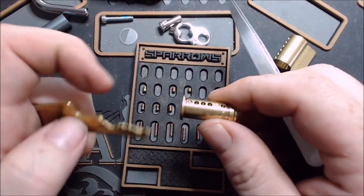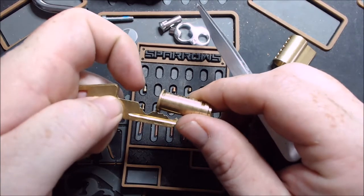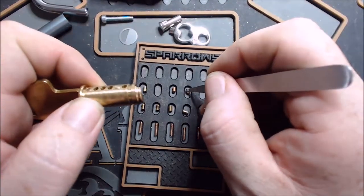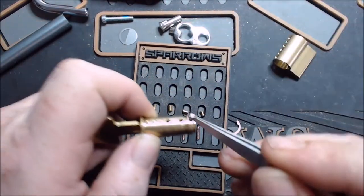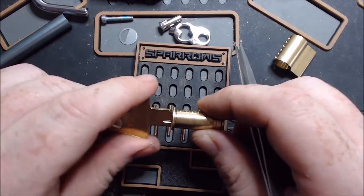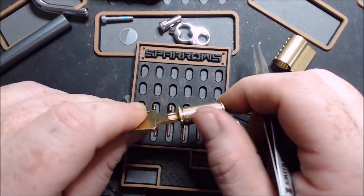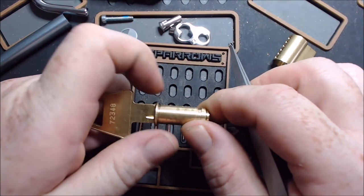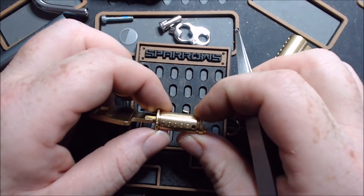So now I've fixed two of the five key pins. Let's pull the lock out. The next longest ones pretty much go from shortest to longest through the next three cuts. The shortest doesn't have any serrations — that one goes right there. The next longest goes there, and then the next longest goes there. Don't be afraid to dump them out and try again if you don't get it right. That's about what it should look like when it's done — everything should be nice and flush. The shine off the edges of the pins betrays how flush it is.